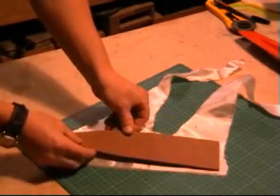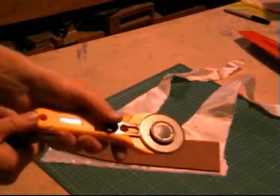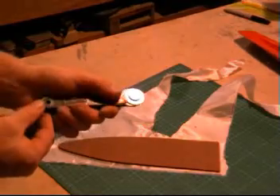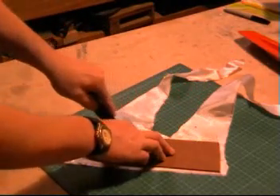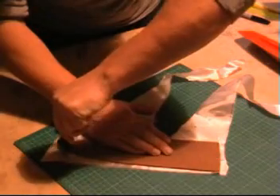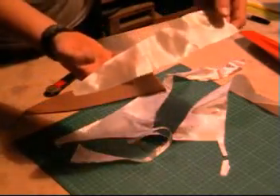We take the fiberglass on a cutting mat and get hold of a rotary cutter — this is just a very sharp disc really. I think they started off with fabric makers, tailors, dressmakers — that sort of thing. I also got this smaller one from wallpaper supplies; it's for cutting wallpaper apparently, but it comes to hand much easier being a smaller radius — you can go around tighter circles. Very sharp, so watch your fingers. Won't work on Kevlar, but brilliant on carbon fibre and any thickness of glass really. Just follow the hardboard round, cut out the shape, remove the template, and lift out the piece of fiberglass. It's ready to go. Cut out as many as you need and then you're all set up to go moulding.